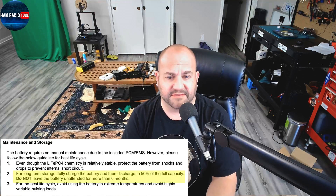Another great use for this is discharging your batteries for long-term storage. Typically with lithium iron phosphate, depending on the manufacturer, they usually recommend anywhere between 50 to 75 percent capacity for long-term storage.